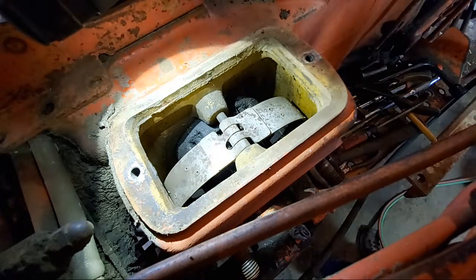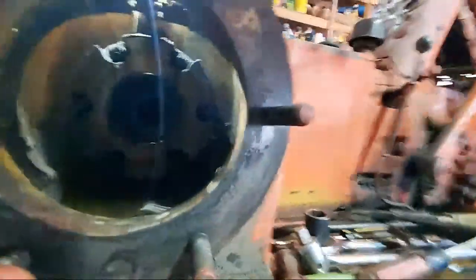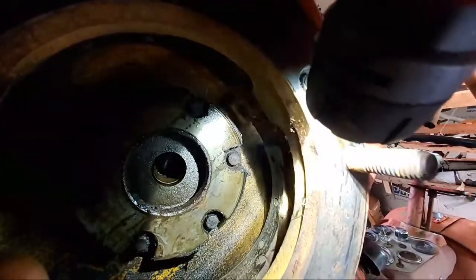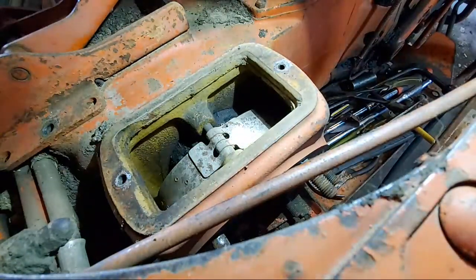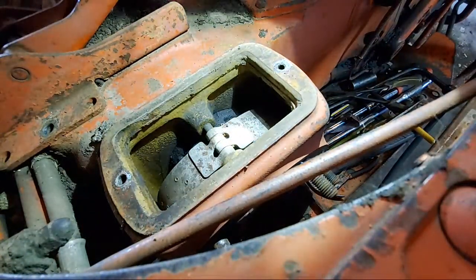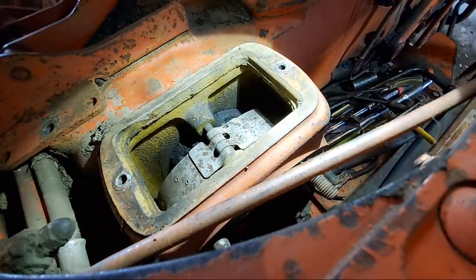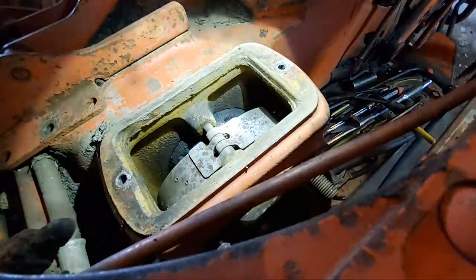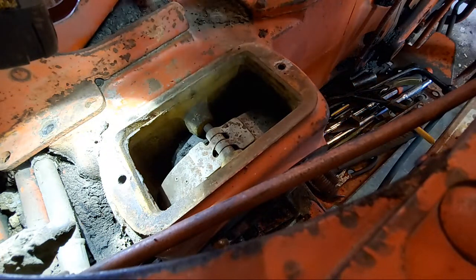So these pads are busted. Something else I wanted to touch base on, the pads in here, let me get my light. The pads are broken, as you can see. Anytime I've tried to reshoe them, there's just rust on them, and unless these metal plates are about perfect, then pads will crack. They usually crack when you're putting them on. But then the couple that I've gotten back together that didn't crack, after a little while anyway, they broke in there, and then we were right back apart with them. I've had the luck with just getting the new pads on there. Again, worth the time and effort. So, without further ado, let's have some fire.